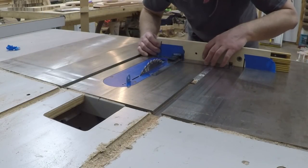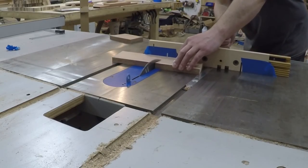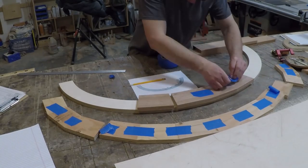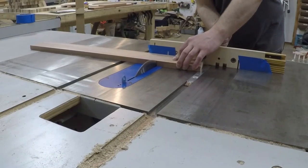Since this is an ellipse and not a perfect circle, each piece had to be cut at a different angle and length from the center of the table to the outer edge to achieve the elliptical shape. I test fitted each piece making adjustments to the angles as I went, and after a little back and forth I had a nice half of an ellipse.